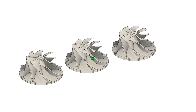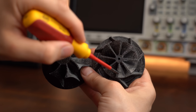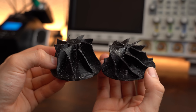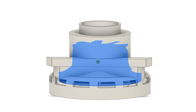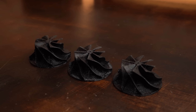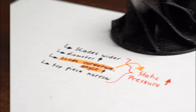We can now have a look at the 3 new impellers Marco came up with, which after 3D printing them with PETG filament look quite a bit different than my design. His blades are wider on the top because the core is more narrow, and on the bottom the diameter is slightly bigger than mine. The curvature of his blades and angles are way curvier and sharper than my design. Combined with a newly designed top piece that stays very close to the impeller, we should hopefully get better static pressure. Design No.1 has the least aggressive blade angle while No.3 has the most aggressive one, and we want to find out whether that directly translates to more pressure.